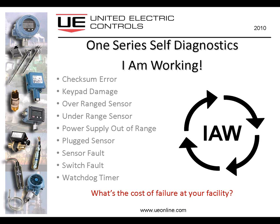We could cause damage to the keypad, for example, by striking it with a wrench. And you might say, well, my goodness, maintenance people would never do such a thing, when in fact, that's how mechanical switches are often tested. To trip the switch, they'll whack it with a wrench to cause the micro switch to change state and make sure that that signal is making its way all the way back to the control room. It's a very crude test, but nevertheless, that's what happens. And if the 1 Series got damaged by somebody doing that, it would know it, and it would report it.